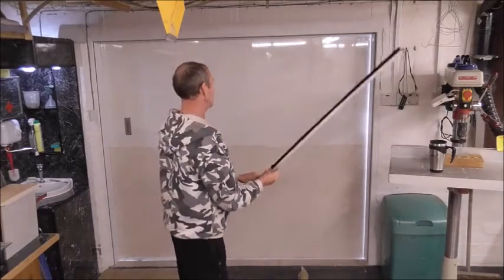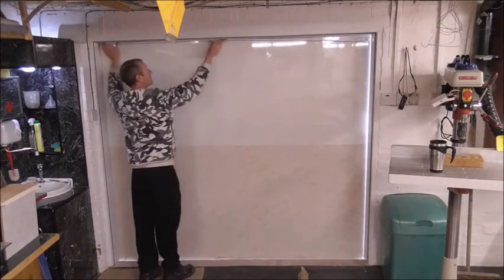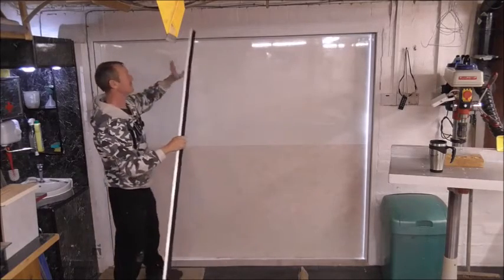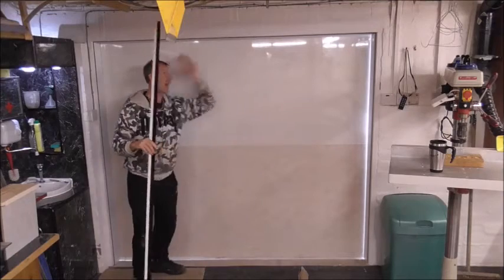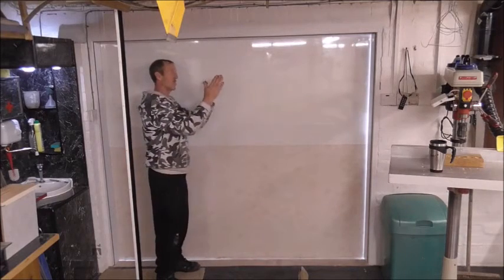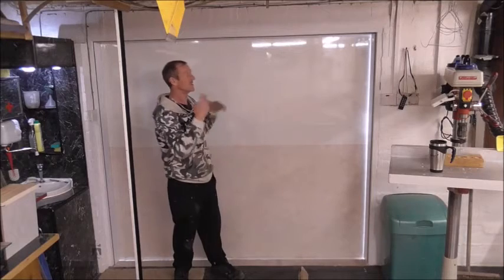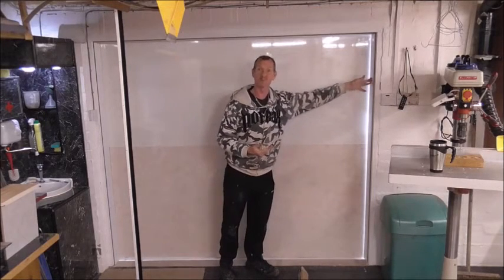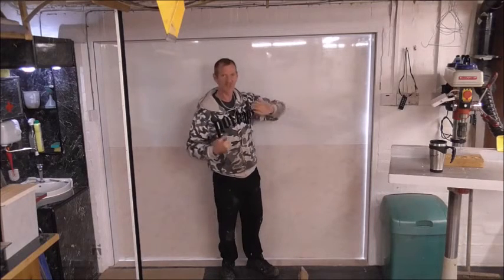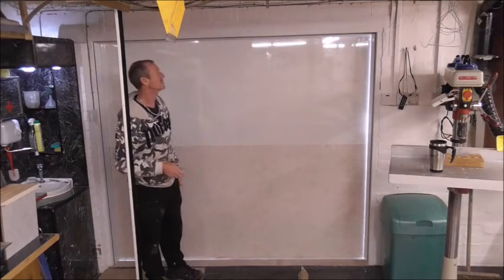Okay, I've got a good long bristle, but I've already partially closed it up with PVC boxing, so I don't have a lot left to cover up. But a little bit is enough to stop the draft. Now there is some difference in the gap from when it's open to when it's closed, because the wall is off, the whole door moves a little bit unevenly to open. So it's widening and narrowing as it goes. Unfortunately, when it's closed, it's the widest gap. If it had been the other way around, then I could have used probably a solid with just a sponge on it or something, and it would have pulled into it as it closed. But the other way around, whatever's going to touch the door when it's closed is going to touch it hard when it's opened, which means it's going to want to stop the door moving. So, brush was the only answer.